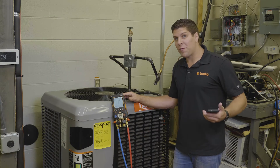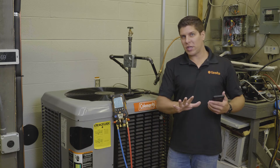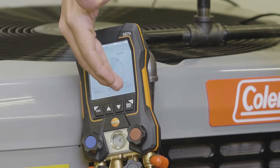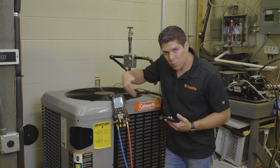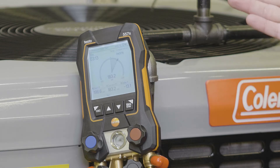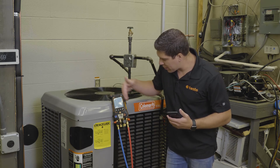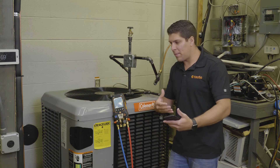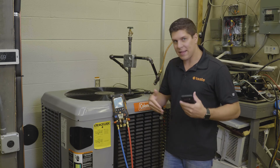We let the manifold run for about three minutes, and what I wanted to demonstrate is what the final result looks like. Testo gives you the timer, the start pressure, your current pressure, and the delta pressure. When you stop it, it gives you the reading as to where you're at. As you can see, we have a delta pressure of minus 13 — a pretty wide opening of the graph. With the new digital display you can see that a wide opening may indicate a leak or a fitting that isn't completely connected, so that's where you as a tech come in to diagnose the problem. A skinnier pie means you should be okay.